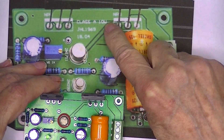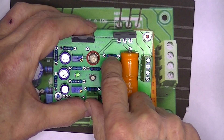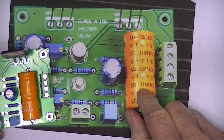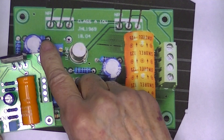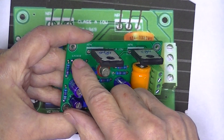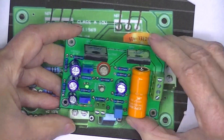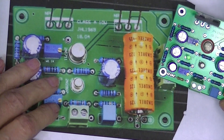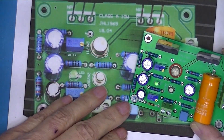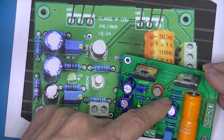The trace on my populated board has a little dog leg to accommodate this extra resistor. The boards without that resistor have no dog leg, no resistor, and no identifying number. Mine has an identifying number. This is a fairly important resistor — comparing the two amplifiers, all other components are identical; they didn't simply move this resistor elsewhere on the board.